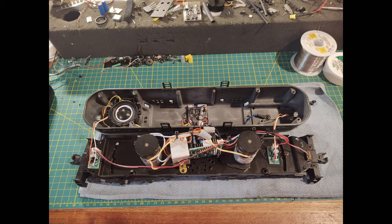With a bird's eye view you can see all the electronics installed. In the center is the Electric Railroad Cruise Commander mounted sideways on the frame. I had to do that so the wires could fit coming off the board and going to wherever they needed to — mounting it flat would have messed with the wiring. You can also see the rail sounds commander mounted up in the shell, the speaker on the left, wires running to the headlights, and those small LED lighting boards used to achieve the LED lighting on TMCC engines.